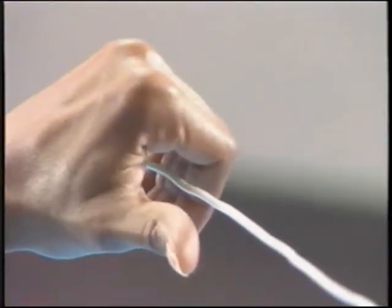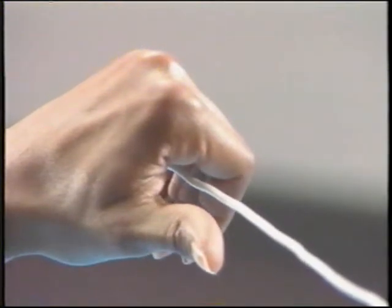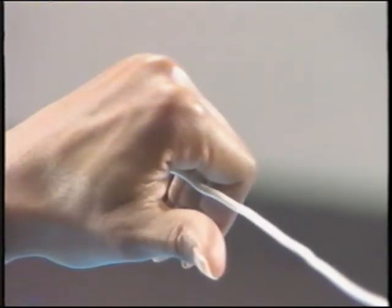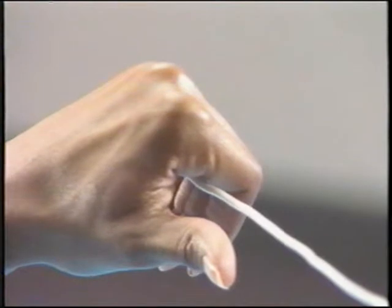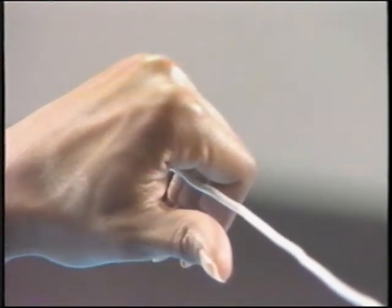This length of insulated wire will be used to demonstrate. Curl the fingers of your left hand as if you're grasping the insulated conductor. Make sure that your thumb is pointing in the direction of the electron current flow. In this position, your fingers will automatically be pointing in the direction of the magnetic lines of force around the conductor. This is called the left-hand rule for conductors.